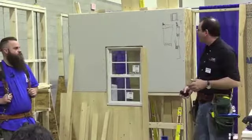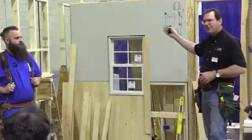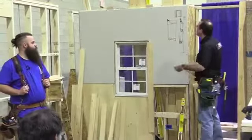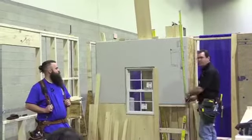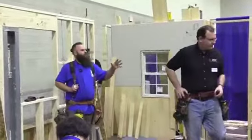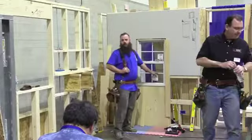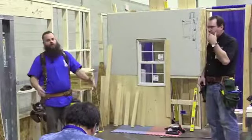You may see some really high wainscoting, which looks neat. For our purposes here, we're assuming roughly a nine-foot ceiling—our walls cut off at seven and a half feet due to constraints with this set. In reality, the wall would come up another foot and a half and the proportion would be much more pleasing to the eye. Also, I'll often go into a room and look for an architectural line—like a mulling strip in a window—that I can accent off of, which allows the whole thing to tie together into one cohesive feel.